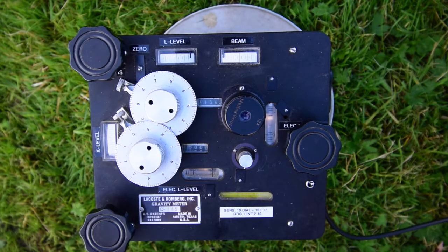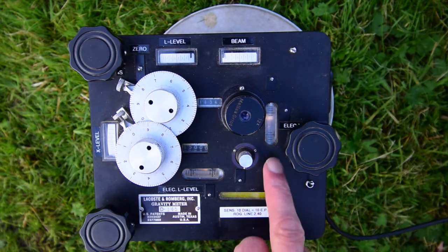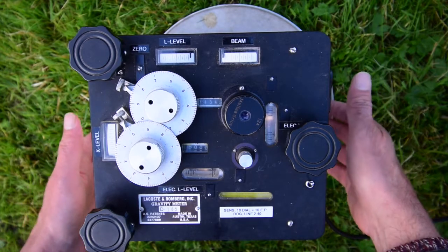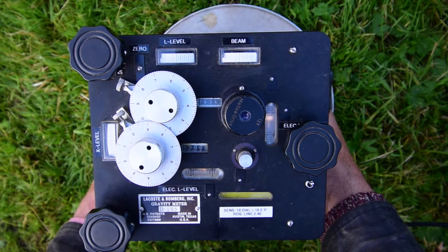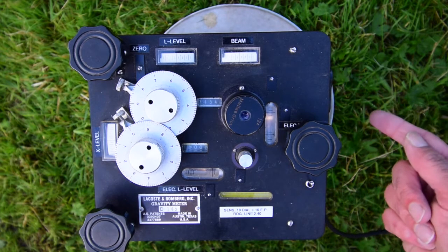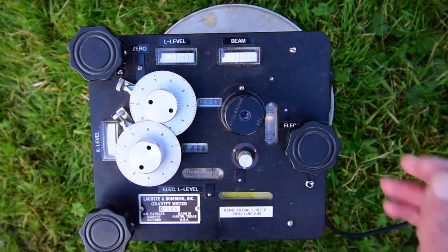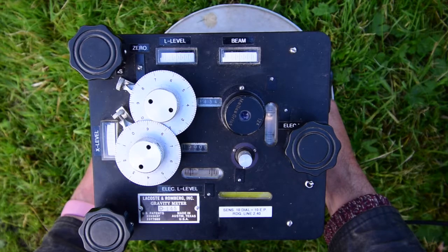So our first job before we take a measurement is to get the instrument perfectly horizontal. And to see whether we've done that, we have two spirit levels here and here. The dish that the instrument sits on is slightly dish-shaped, and so we can get the instrument level just by moving it left and right across the dish and watching this bubble as we do that. The trick here is to think which way you want the bubble to go and push the instrument that way. So now I want this bubble to move away from me towards the top of the picture, so I push the whole instrument in that direction. The bubble goes the way I want. It's gone too far now.